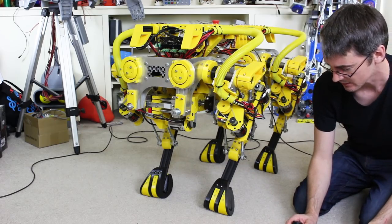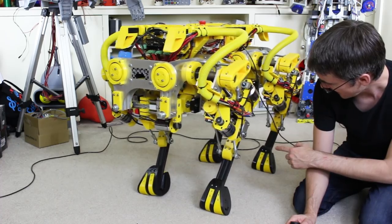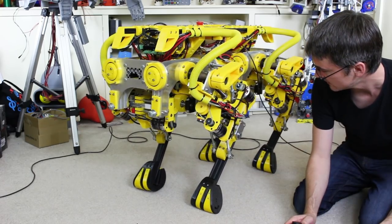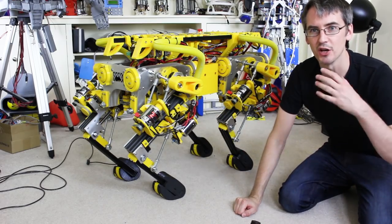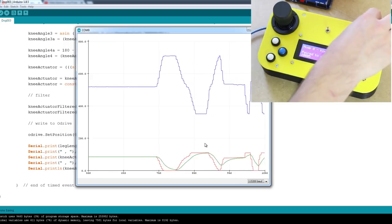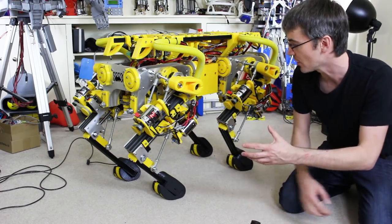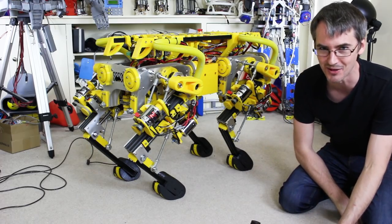It's looking a bit more believable now. Let's try that again — I just have to be careful with this controller, and as you'll see it always falls this way, so I'm just going to bias it the other way a little bit. I've tuned that PID controller a bit and the step timer that controls when legs move and how long they stay up. Most importantly, I've tuned down that first-order motion smoothing filter — check out episode two for that. The value was hard-coded at 50 and I've turned it down to 10, which makes the movements much sharper with no deceleration. Even though the motors aren't going faster over the whole travel, they do get there quicker. Now the motions are a lot sharper and the PID controller is tuned with a bit more D — it's not perfect but we're getting there.